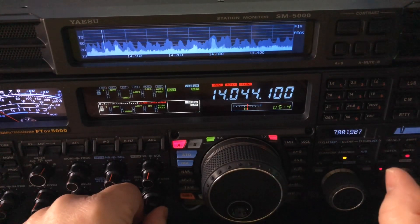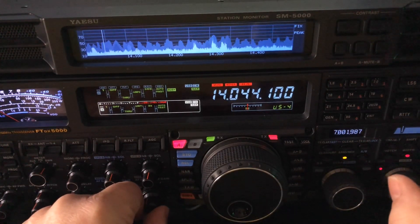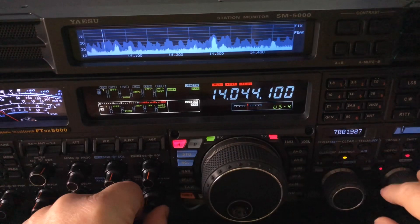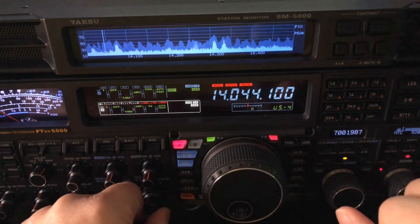Put your manual notch starting at 520 if you're using a 600 hertz side tone — that's 80 hertz below the side tone frequency. Then just move it up or down, plus and minus, until you've successfully knocked out the offending tone.